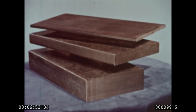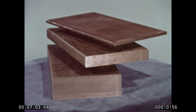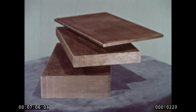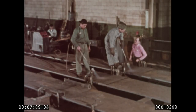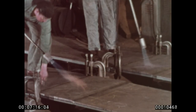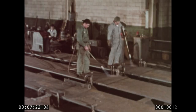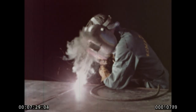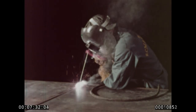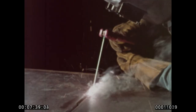Another important consideration is the thickness of T-1 steel. The thicker the plate, the higher the permissible heat input. The thinner the plate, the lower the permissible heat input. In nearly all T-1 steel welding jobs, the only preheating necessary is that required to ensure a dry surface. The lower the temperature before welding, the sooner the metal cools. Welding can generate temperatures up to 11,000 degrees Fahrenheit, but by careful attention to arc speed and amperage, welding heat is easily controlled.